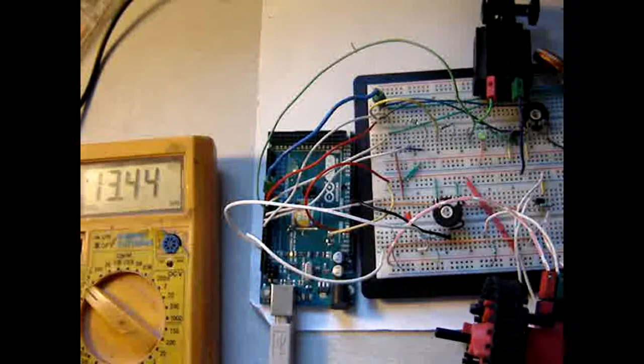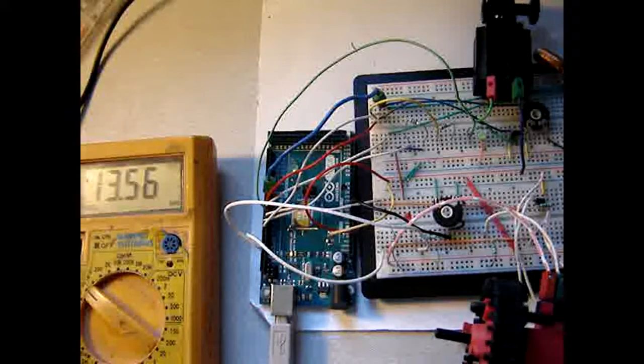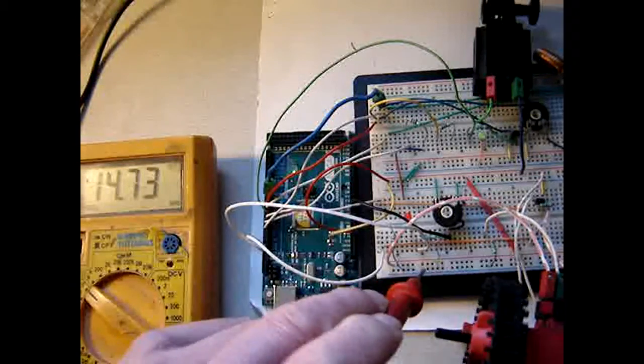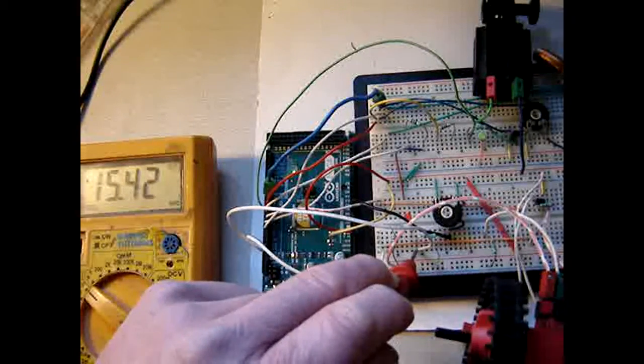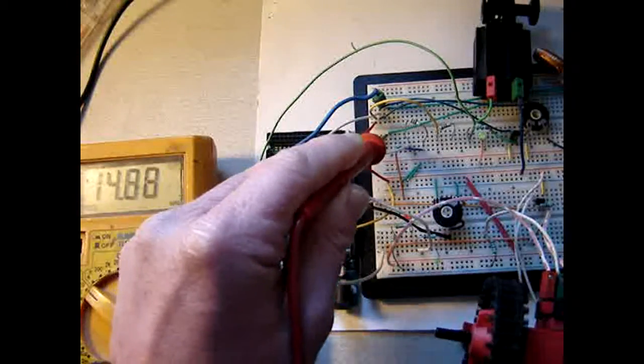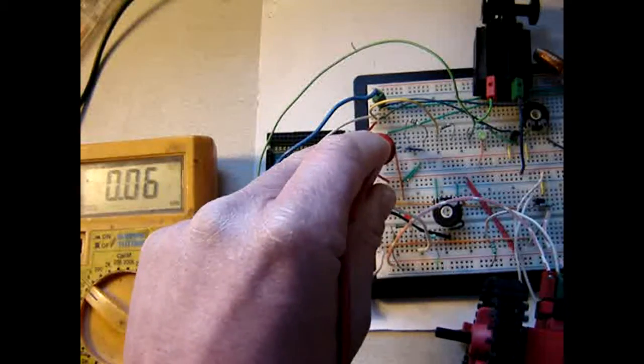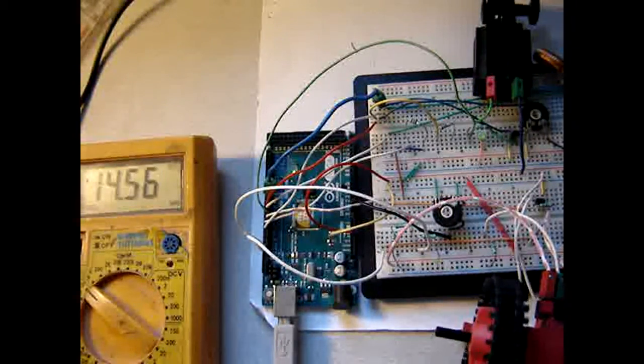This means that 13 is not adequately configured. And that's a big disappointment. Does that mean that 13 is broken? And another question, is there a way to fix it? Because this proof is more than clear. This is 16 kilohertz or about. This one, pin 4, is clearly 60 Hertz. So there's no doubt possible.